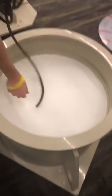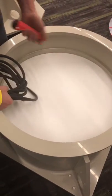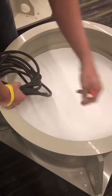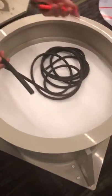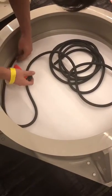Then you use a gasket. What the gasket does is it seals around the paper so you don't have any leaks. A lot of the time you'll lose vacuum because air is getting through one of the sides, or even worse, some of your waxes might actually be going through the sides. You just grab any kind of non-blunt object and shimmy it into place.